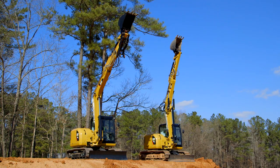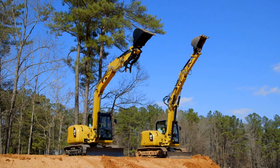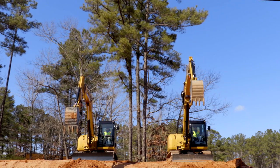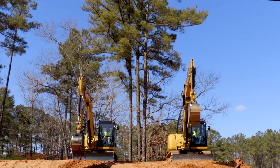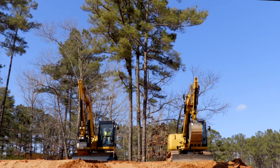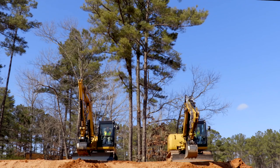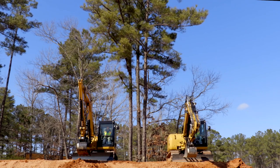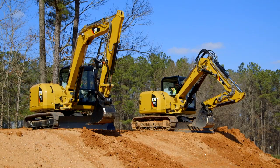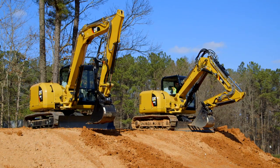What we're going to do now is bring our boom down and our stick in and we're going to look at the dig-to-blade aspect. A lot of people like to crowd their bucket to the blade to pick up material. With our VAB we can actually bring the bucket teeth all the way into the blade — something you can't do with a standard machine. If you look at the standard machine linkage, it is going to stop right there in front of the blade. If you watch the VAB you will see that I can actually come all the way in and touch my blade. Using the VAB I can actually do bucket-to-blade with no problem whatsoever to help with my clearing up.